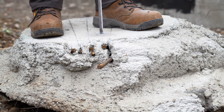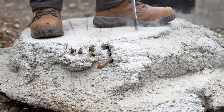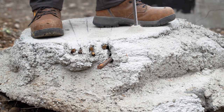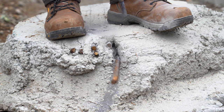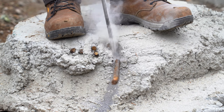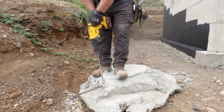I also want to be transparent: I sped up a lot of the drilling in post-production because it would be a very long, tedious video. As soon as I've cut through the steel and then through the concrete itself, I drill a hole to show that immediately after drilling rebar, the bit is still hot — in fact it's hot all the way up to the rotohammer itself. Notice it just drills through the concrete without any issues. Even off-center, the bit is still cutting the steel.